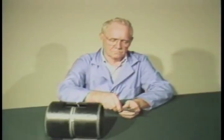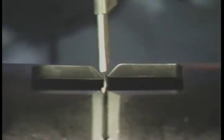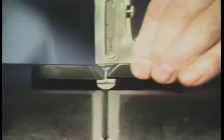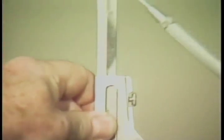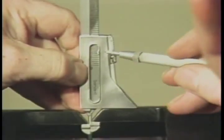Let's start with internal misalignment. First, loosen the locking screw and insert the gauge tip into the fit-up gap. Rotate the gauge 90 degrees and slide the gauge body until it makes contact with the outside diameter of the pipe. This assures that the gauge is square and that the reading displayed is correct. Next, pull down the gauge until the internal alignment stops are snug against the inside of the pipes and read the misalignment on the scale. You can use the same procedure to measure pipe wall thickness after fit-up using the material thickness indicator and this scale.